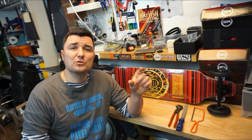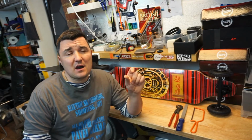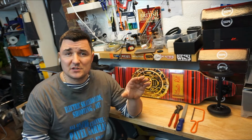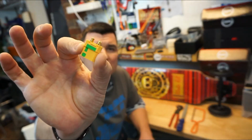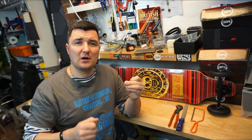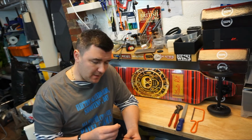You can also use just a key which you can make out of the XT90. I have used that as well. It's very simple and cheap. It's the anti-spark connector. That's one of them with that green marking on it. So you make a loop and you break your positive. So when you pull it out, you break the positive, so your board stops being live. And you plug it back in, it's live again. That's it pretty much.